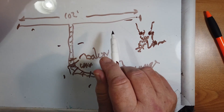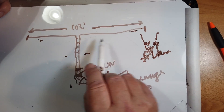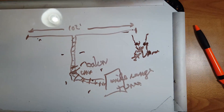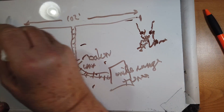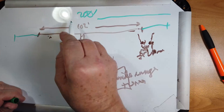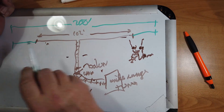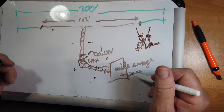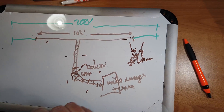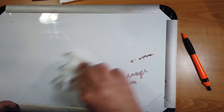Note that this is a non-resonant antenna — therefore it is not a dipole. It is dipole-like in that it's a long wire antenna broken in the middle. Now, if you make this longer, as Ken has done — 200 feet from end to end — you've added some length, which means it will affect the tuning quite a bit, and you'll probably be able to tune it up on 160 meters. Does adding more wire to an antenna like this help?